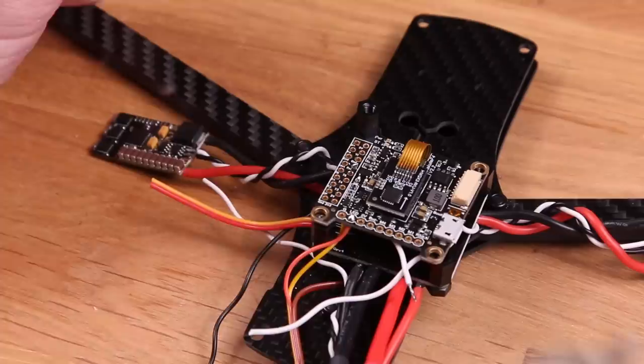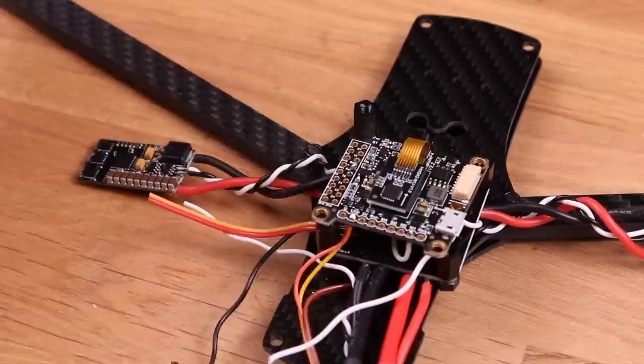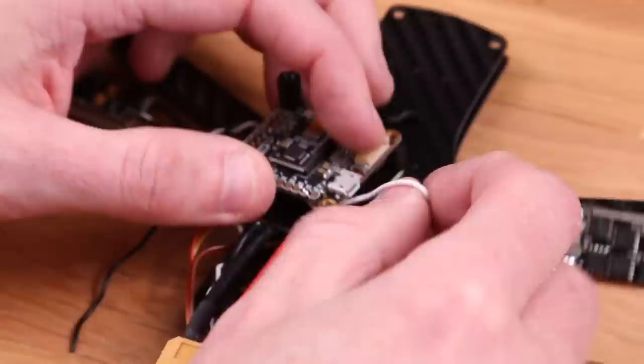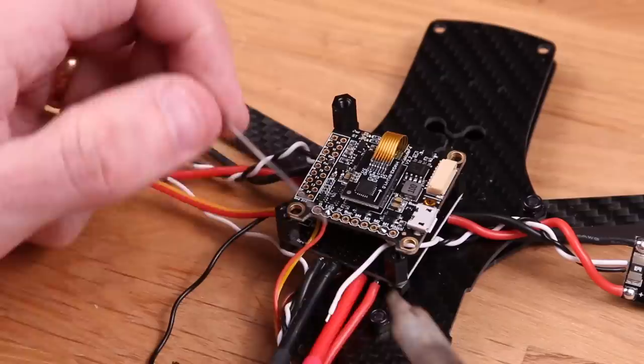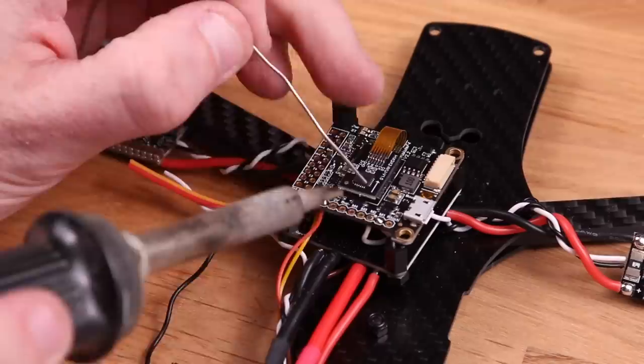The servo I'm using in this build is the custom RC Explorer one. It has a servo feedback wire, which tells the flight controller where the servo is at all times. It's very fancy, but not all flight controllers have an analog in you can use for this. What I'm doing now is connecting all the signal wires from the ESCs. I'm cable managing here a bit as well, so optimizing the lengths because I don't want like a rat nest of stuff. I want it to look clean.